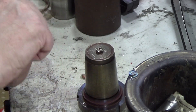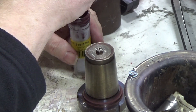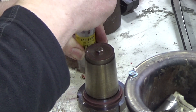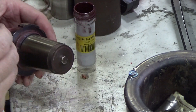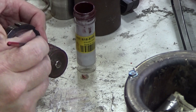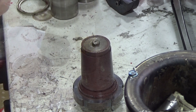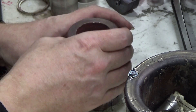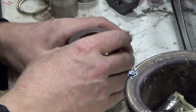The pattern is then painted with a mixture of white spirit and rouge. Traditionally the mixture includes egg white and water and other things, but I've found that simply white spirit and rouge seems to stop the pewter sticking to the mould and also fills up some smaller gaps in the mould through which pewter can creep. With all parts of the mould painted with the anti-flux, the outer part can then be slotted on top and the whole thing goes into the oven for preheating.